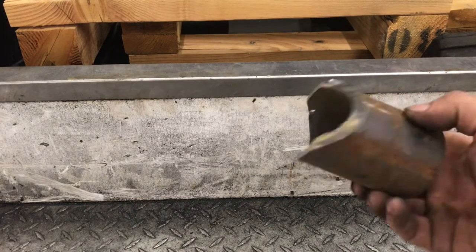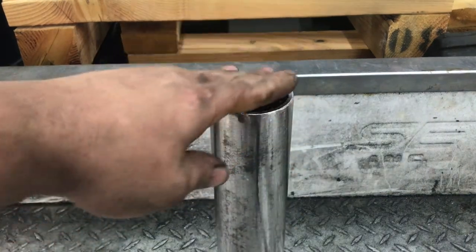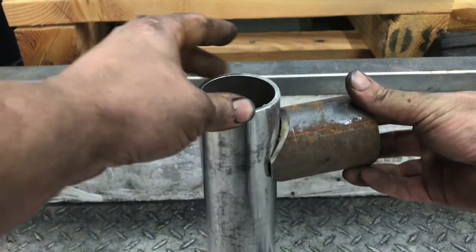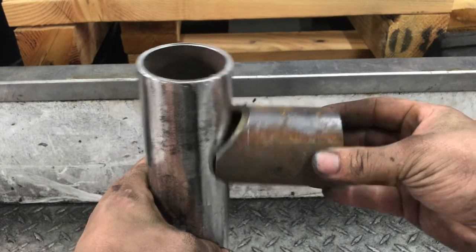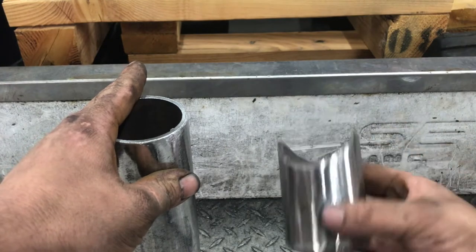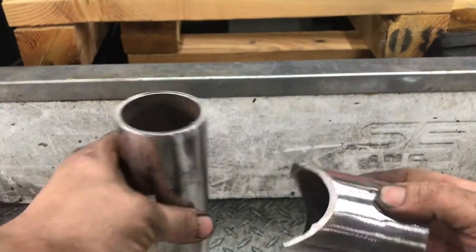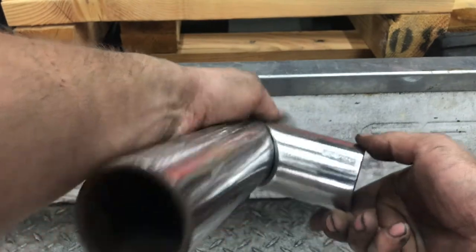So here's our fresh cut-off with no cleanup whatsoever. And here's what's going to be one of the corner posts for the cooling rack. It's not a terrible fit. There's a little bit of gap and that's totally fine. So let's take this one, give it a full cleanup, and just ramp out the edges on both sides — just to take basically the thickness of the material down. We're not actually changing the radius. That's a pretty darn good fit.